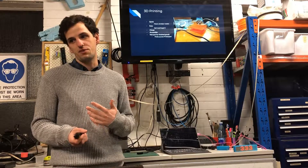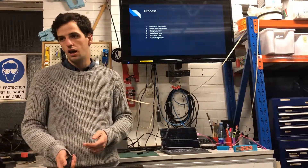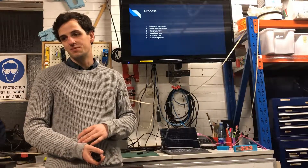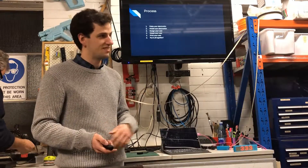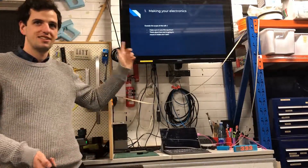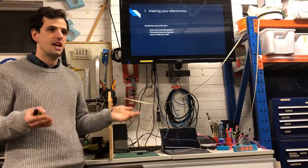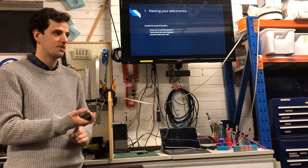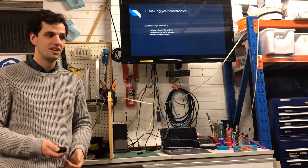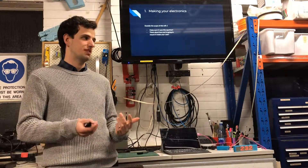What I'm going to talk about is the steps and a few of the tools involved in making that happen. Step one: make your electronics — this is the part I'm hoping people are familiar with. Don't forget to make your electronics run MicroPython. One big important part is to think ahead of time about how your electronics are going to work inside a case. Mounting holes are very important and they're very hard to solder on at the end, so do it in advance. Even when looking at dev boards, if you can get one that's got two little mounting holes in either corner, it's going to make your life much easier.